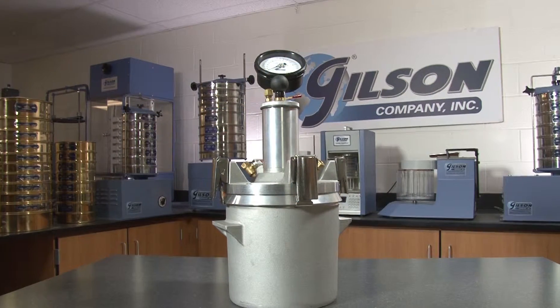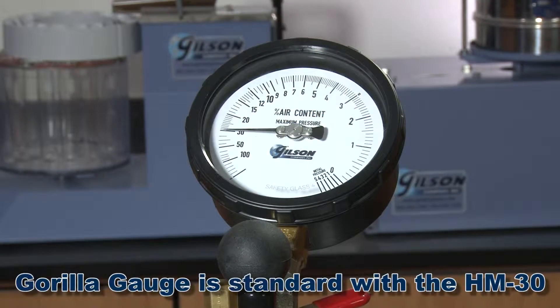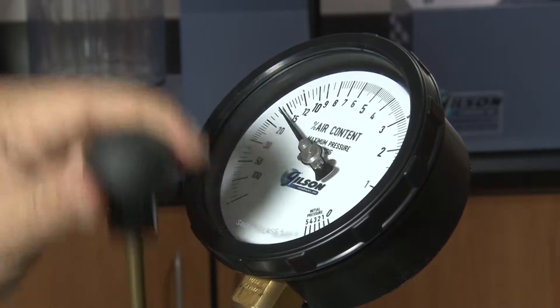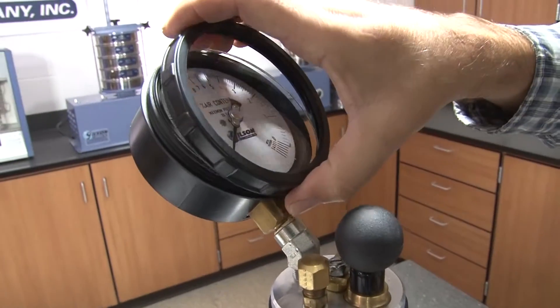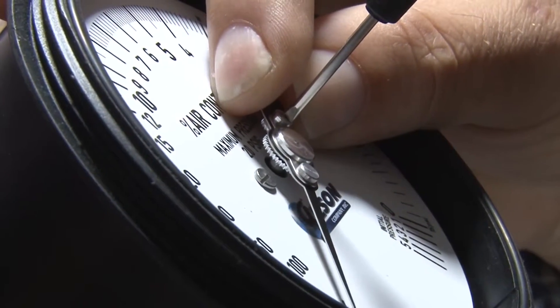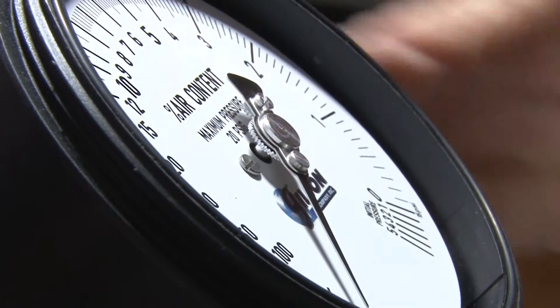The accurate and durable HM30 features the Gilson exclusive Gorilla Gauge, a rugged German-engineered gauge with precision jeweled movement rated ANSI B40 Grade 2A. It has a waterproof and rust-proof high-strength Polymed B molded housing with a safety glass lens for the ultimate in gauge safety. Micro-adjustable calibration screws ensure superior accuracy and save time during calibration and maintenance procedures.